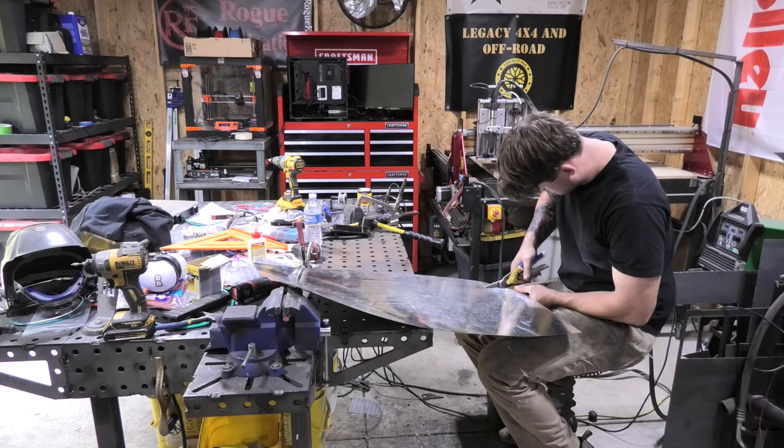What I'm gonna do is I'm gonna take a flat piece of aluminum duct that you can get at any Lowe's or Home Depot, stuff like that. I've got two small pieces of that. I couldn't find something that was exactly what I needed it to be, so I'm gonna make my own out of a piece of flat of this aluminum duct material. It's gonna bolt into the bottom of the blower, and then just gonna be basically a tube channel thing down the side of the oven that then runs through that hole at the bottom of the oven to provide that convection effect. Anyways, let's go ahead and get built on that. I'll show you guys what it looks like, and then I'll show you what the rest of the oven looks like before I move on to the next step.